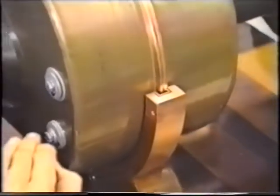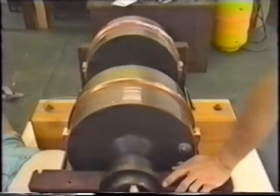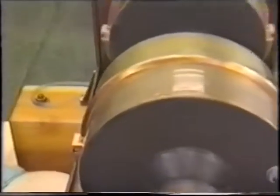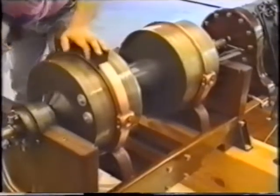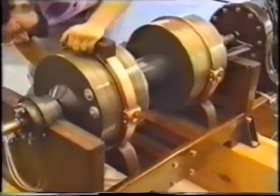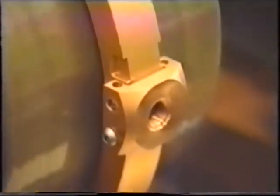Here is the bottom half of the liquid metal current collectors, or brush system. Within a copper bus bar, a slot is cut, as you see here, and the copper disk rides within this slot, along with a thin volume of mercury, which completes the electrical contact once the upper half of the copper bus bar is placed on the brush mechanism, as you see here. This is a terminal from which the electricity will be drawn.